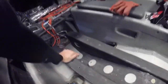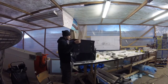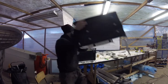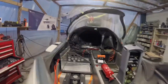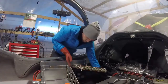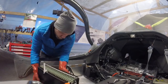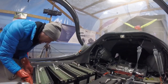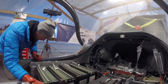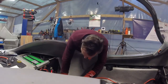Here you can see the base a few days later — rigid plywood pieces laminated together — creating a flat base so we can move the whole battery pack and casing back and forth. We can move it about 25 centimeters, which should be ample leeway to test forward and aft CG. Here you can see the casing created based on the existing structure, open in the passenger seat, and we started carefully putting in the battery modules again. Working with batteries is no joke — there's a lot of power in these boxes — so I'm wearing heavy gloves when handling them.